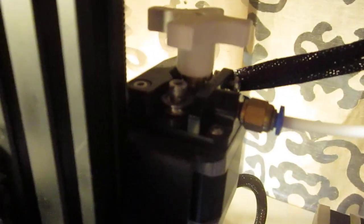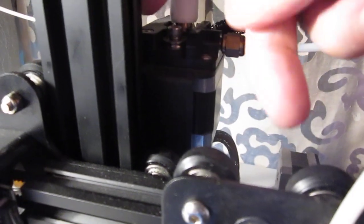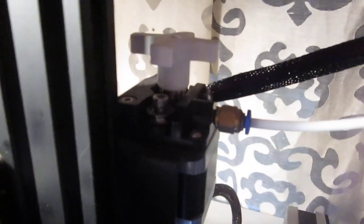No reason for me to change to a metal extruder because there just seem to be so many issues with that, looking at past posts and stuff, when all you really had to do, if indeed the lever cracked or malfunctioned in some fashion, is just purchase the arm, because an arm purchased from the manufacturer or the supplier has never been installed, so it's literally brand new, straight out of the package. Takes like 5 minutes, about $3. Remove that screw, replace the arm, and start printing again. I mean, it's within a few minutes, and you can start printing successfully for the next several years.